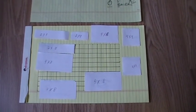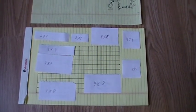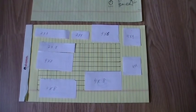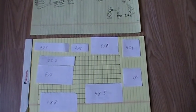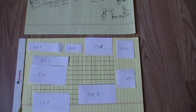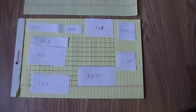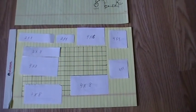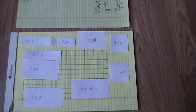Now I know that with a lot of the videos that I've seen, it says that you shouldn't put a board across one span of trusses. You should always go 2 or more spans of trusses. That's why you see some are 2x4 sections, 2 foot by 4 foot sections, but it's only 2 foot high, but it is going to span 4 spaces across. So I'm not going to be keeping any of the boards shorter than that required amount for the flexing and everything else. I want everything to be as supportive and as strong as possible.